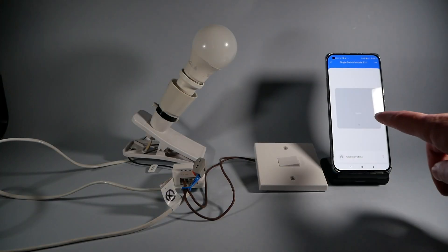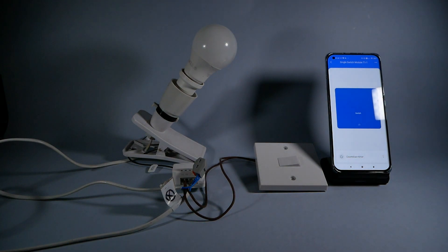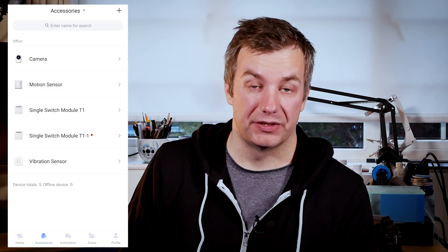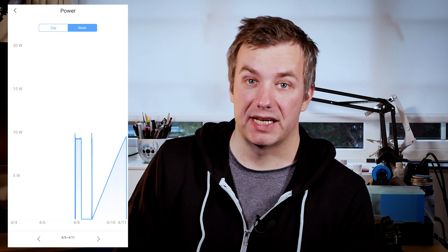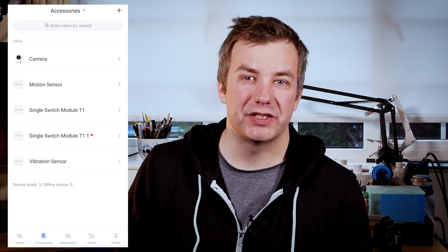Now let's take a look at the Aqara app. You've probably seen it in my last video — it's very zen-like and clean. Both switches take about half a second to update whether using the app or a voice assistant, while changes are near-instant if you're using the wall switches. The switch with a neutral wire includes electricity monitoring, so you can see current power consumption and total consumption over time, split into day, week, month, and year views. Schedules and timers are moved into an automation panel, so they're not in the individual switch menus, but they are available — so don't panic.